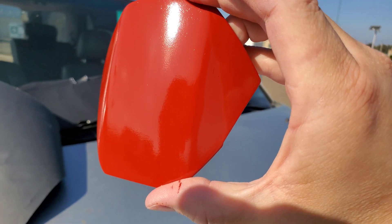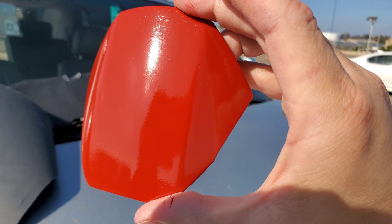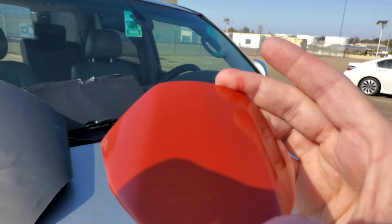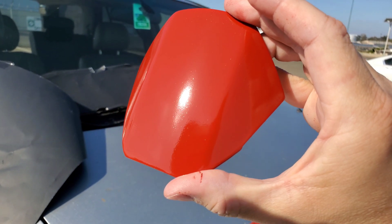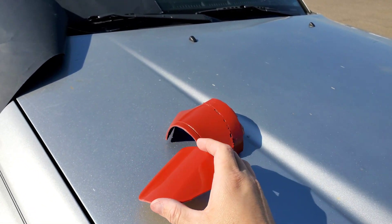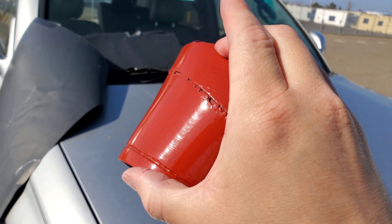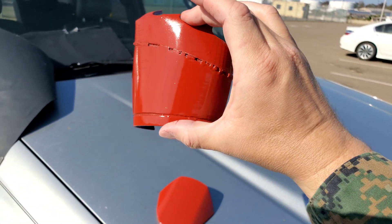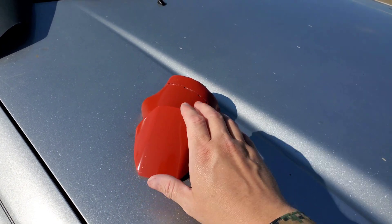For comparison, this bicep piece was printed on a CR10 at 0.2mm layer height, a finer print, and then sanded up to 500 dry, primed, sanded from 500 up to 800 dry, painted, wet sanded the paint, and then applied a second coat — and that's what that entire process looks like on just that tiny piece. It's beautiful, but the cheaper print with UV resin already competes. Going forward, I'll use resin when I want a very nice shiny part quickly. If you like this kind of content, subscribe, like, and comment!